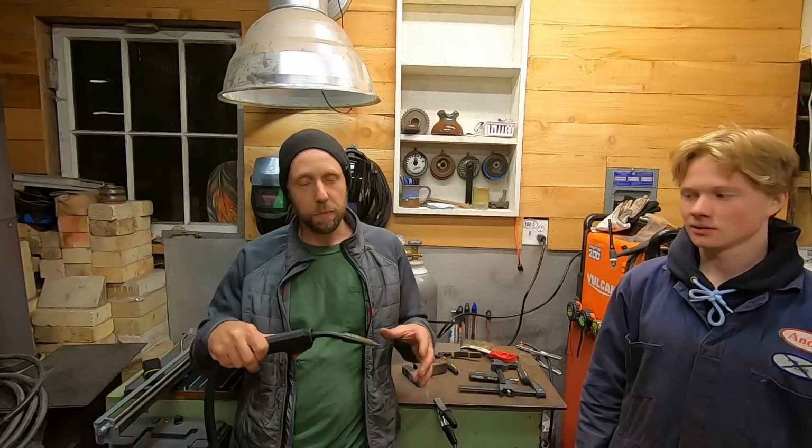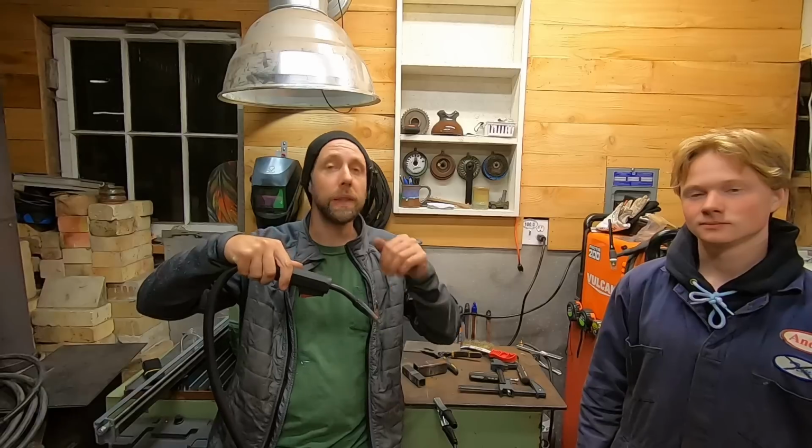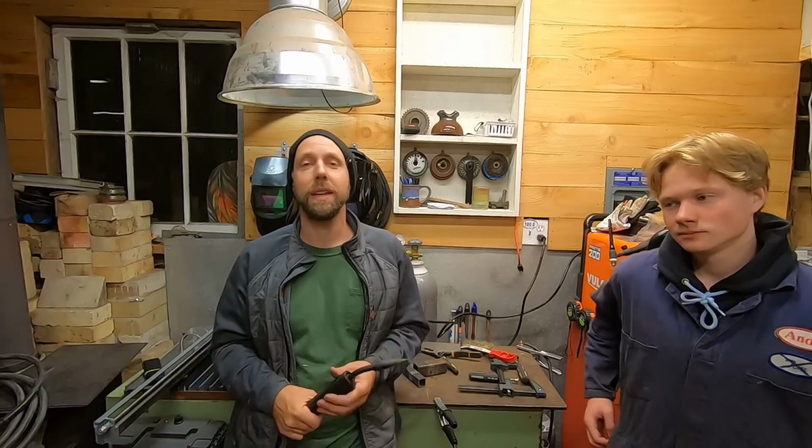So a few last things to mention. Like I said before, if you're welding and you end up stopping a weld, sometimes you'll have a crater in there. Sometimes you can just pause at the last little bit for a moment and just fill that last little bit and leave less of a crater at the end of your weld. Another technique to work on later, not something to worry about right off the bat, but make it a consistent habit to do. Make stronger welds.